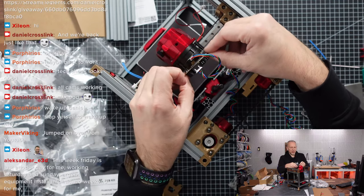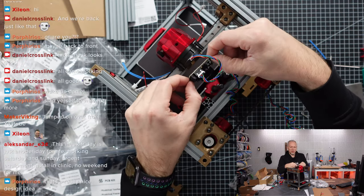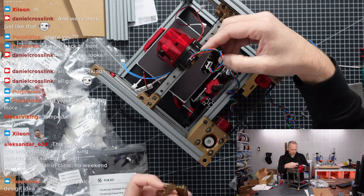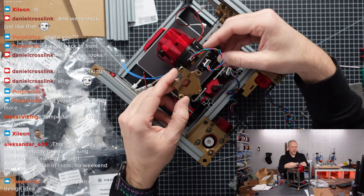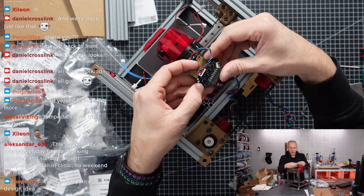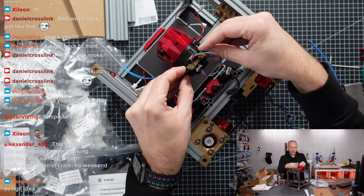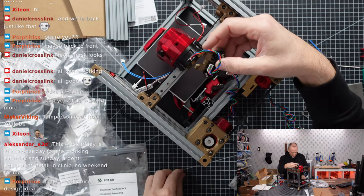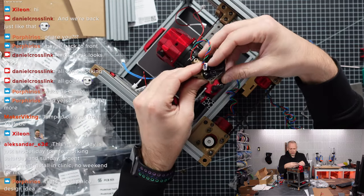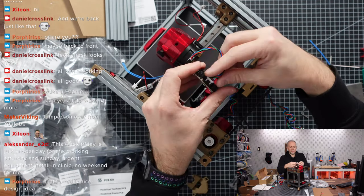The mounting position for that is behind the motor. There are two holes here that fit the motor screw distance perfectly. And there is another little distancing piece here that I printed yesterday because I completely forgot about that, which is going to hold this part. It's going to be mounted to the back like this. I also have two little plastic spacers, which I don't yet know exactly where they are to be placed, but we'll see that in a moment when we start attaching this.